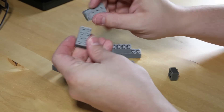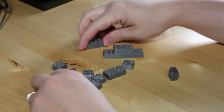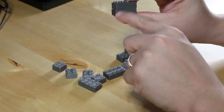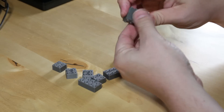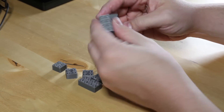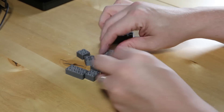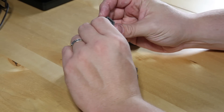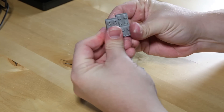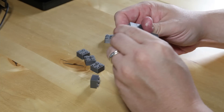Both the hollow and the solid pieces work equally well, and they do snap right together. The pieces are very, very uniform and flat. I printed with default settings; I did set the fan to come on after the fifth layer to avoid some warping. If you look at some of the early printed pieces, there's a slight gap — it doesn't affect how they connect together, but it was from the piece trying to peel away from the platform because the fan was coming on too early. With a little bit of tweaking depending on your environment, humidity and temperature, you can get your printer printing stuff like this that's ultra precise. And come on — if you can print a Lego, you can print just about anything, because if it was off by more than a tenth of a millimeter, probably these wouldn't snap together. And they do.